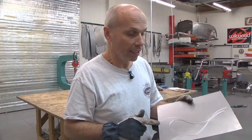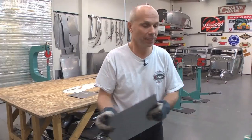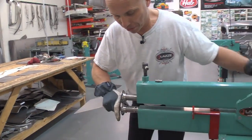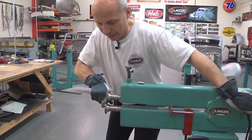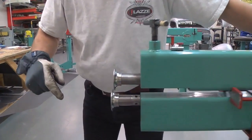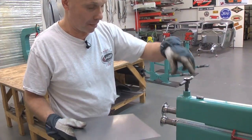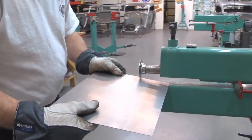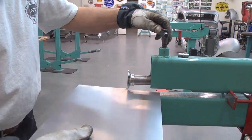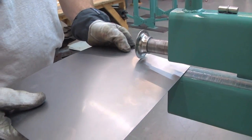The next thing I'm going to show you is how to make a floor panel with the same dies but just a little different setup. So I go get another piece. What I'm going to do now is adjust the dies so I have a bigger gap between them — it's the same dies as before, I only adjust the shaft. Turn this down, maybe a little more like that. Let's see what profile I'm going to get. Probably can go a little deeper down like that.